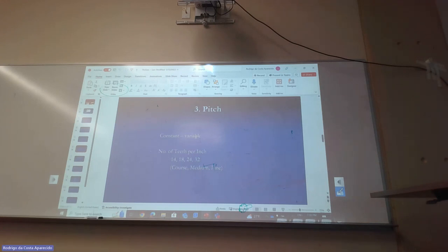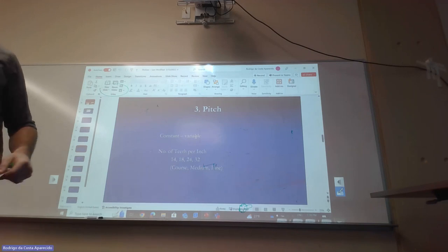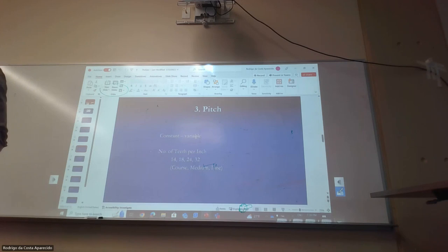Usually all these things have a reason. Like for us up until now, when we get one like this, why would I pick this one? Let's say, to make it easier on you guys choosing. If we look at these two blades, they're both for two different materials. How can you tell that? The bigger one is for softer material, with the bigger, wider gaps. And the smaller one is actually for harder materials, right?